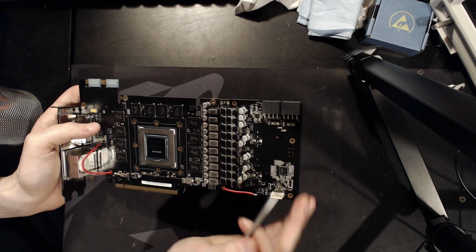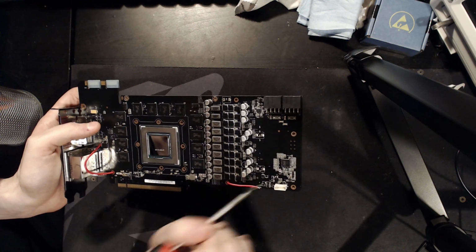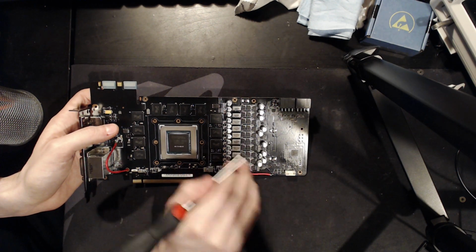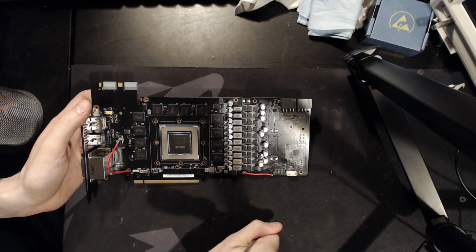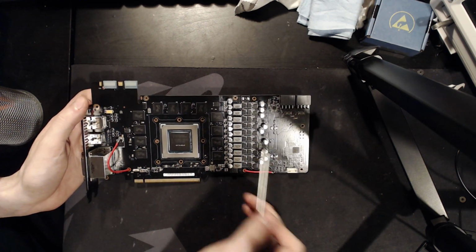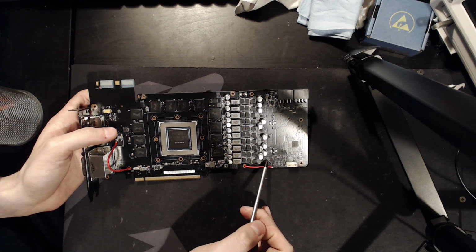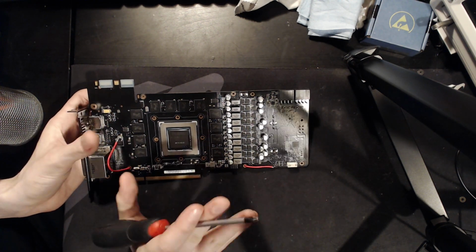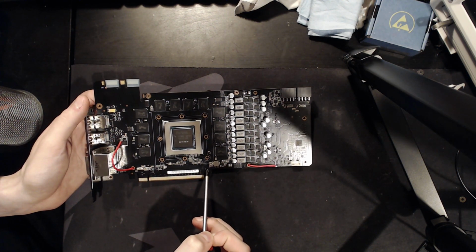The other way you can tell this is a real 8-phase is there's actually 8 phases worth of current sensing circuitry hanging around the Digi Plus voltage controller. So yeah, the VRM is a real 8-phase, but it's not turning on, and it uses these IR3598s. So I go and get the data sheet for the IR3598s, because tracing it out is a nightmare on a black PCB. But if you go from these IR3598s, there's this big fat trace, and fat trace means some kind of big heavy power line. It goes right along the bottom edge of the PCB to where the crack is.